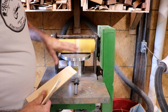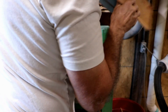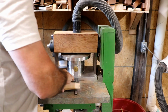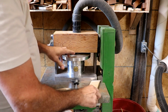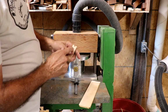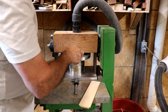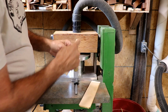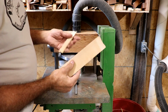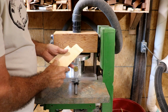By the way, for really small things, especially when the shield is on here, it takes up so much space. When the dust collection shield's on here, you can't get your fingers in there very easily. On little tiny parts, sometimes you need to get in there and push it on through. So I make all kinds of little specialty pusher sticks. Like this little notch here, I can put a guitar saddle or something in that, squeeze it in that notch, and then push it on through and pull it out the backside. I make all kinds of specialty little push sticks for this, depending on the shape I'm trying to push through there. It keeps your fingers out of the way and gives constant pressure all the way through the sander.